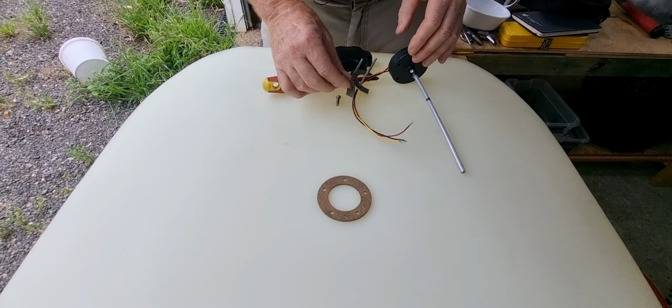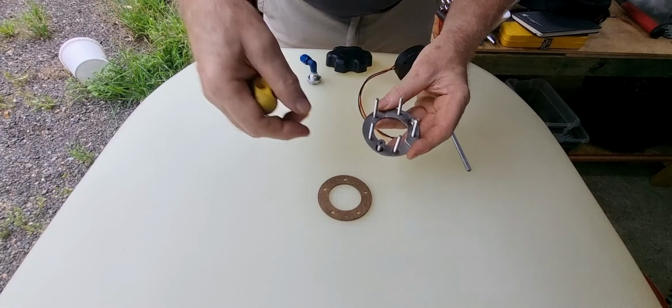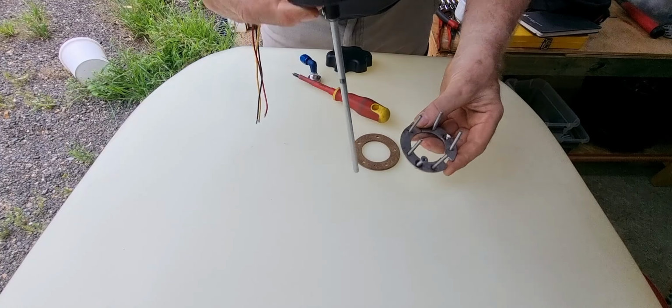I've got a provision with a nut on the underside of that welded for this M5 countersunk screw to go through the tank. So I'll countersink through the top of this tank and screw that into each of the two halves, which will then hopefully pull that up tight enough in a fixed location like that. That will allow me on the top side of the tank to put that washer on and then drop this down over the top of these and put some Nylock nuts on these five, or temporary nuts on there as I'm calibrating this, because I may have to pull this in one or two times. I don't know if it's to be calibrated in the tank or outside the tank.